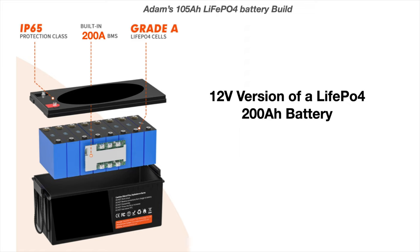What you're going to find on the market are pre-built batteries — nice fancy boxes with logos and stickers — and they're very expensive. This is a 12-volt LiFePO4 200Ah version; you're paying a lot of money for the fancy box. The cells inside them are readily available. If that whole battery bank went down, you'd lose the whole battery — it would be gone for good. Whereas the way I'm doing it, with individual cells, if one cell goes down I can remove it, replace it with a new one, balance the pack, and I'm back up and running.